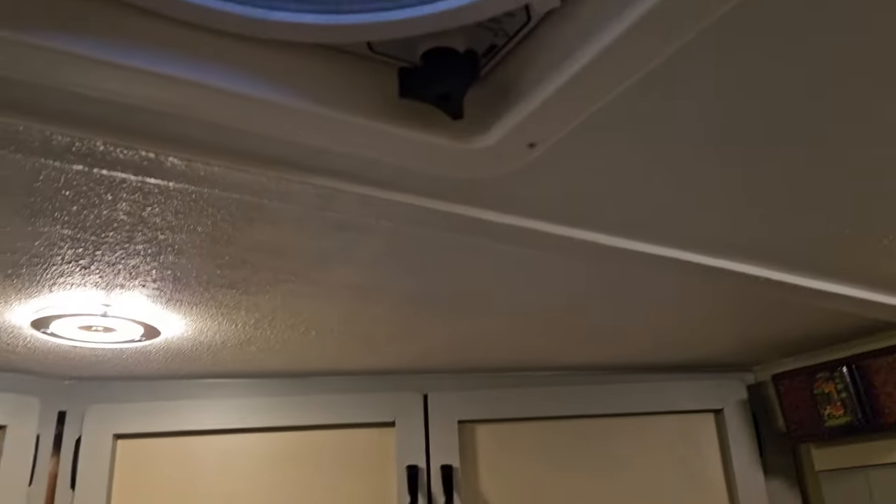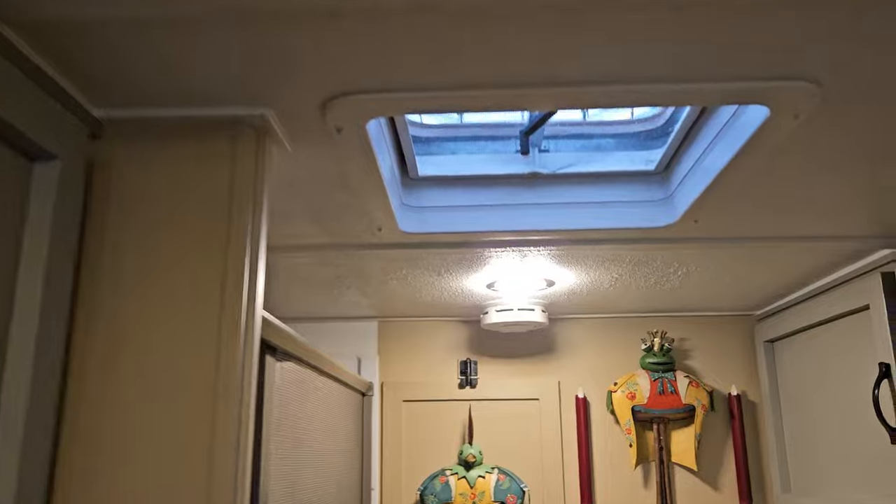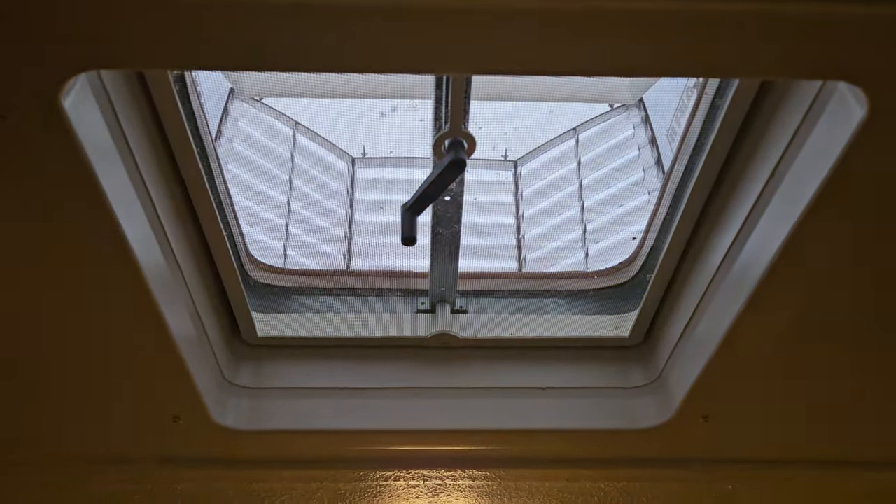Now before you say it — let's talk about insulation and ventilation. The ventilation is running all the time: I have a MaxxAir fan that sucks air out of the house and another vent in the back that's open, with covers so they can run in rain or snow, so I'm constantly ventilating. That wasn't the issue. I have R-Max rigid insulation in this trailer — the most expensive you can buy — one inch in the walls, two inches in the ceiling, and two inches in the floor. It's just that if you live where it's cold and humid in winter, you will have condensation issues.